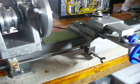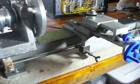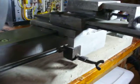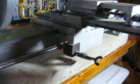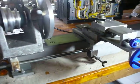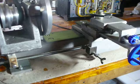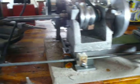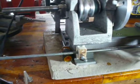I haven't done the split nut mechanism yet. Right now, what's driving this thing along the feed screw is just a piece of angle iron welded to a nut, and then just clamped with a little mini C-clamp to the apron. One of these days I'll get around to doing the split nut, and then add the power feed mechanism out here — that's why all this stuff is longer, I haven't cut that down to length yet.